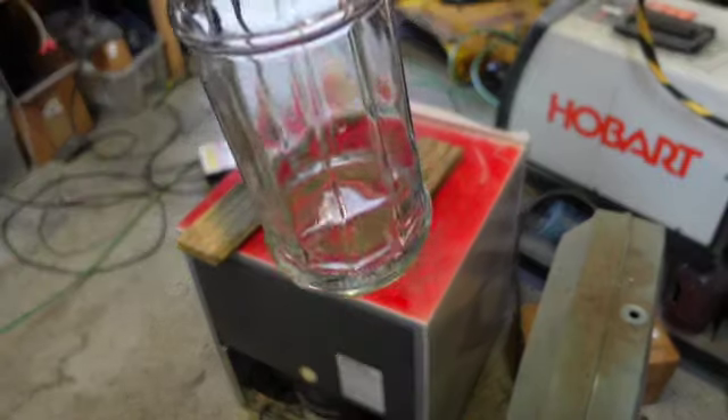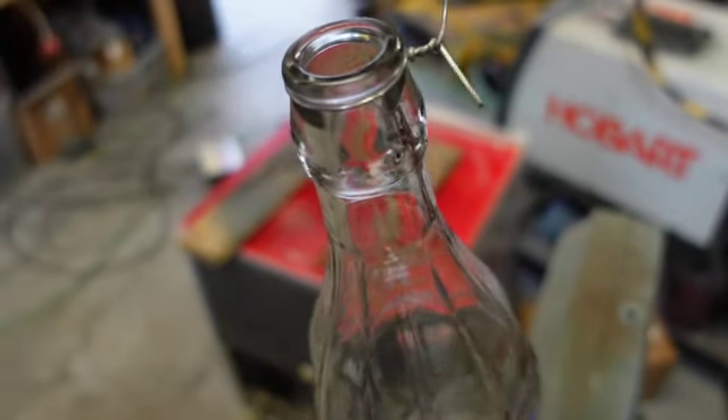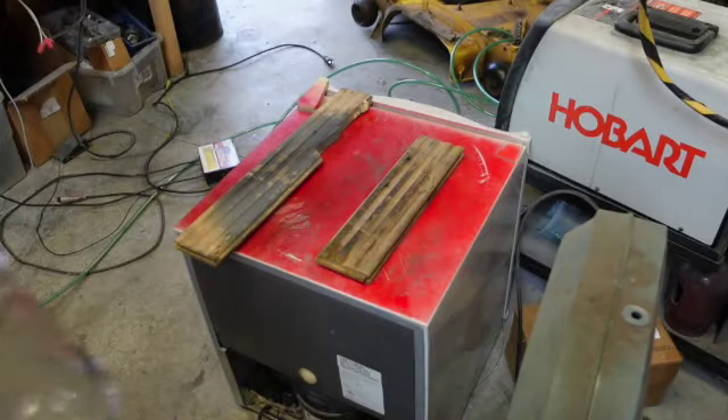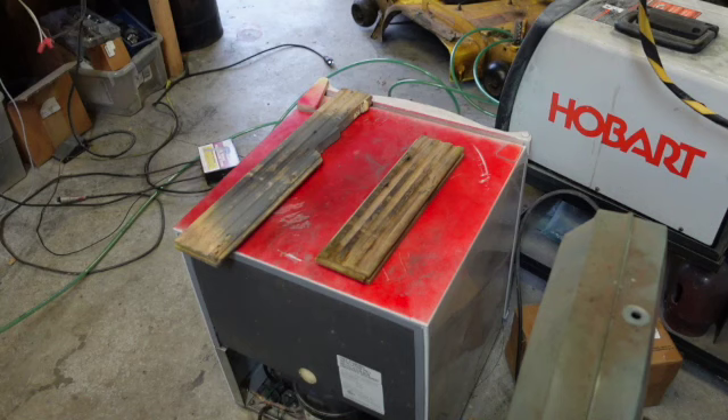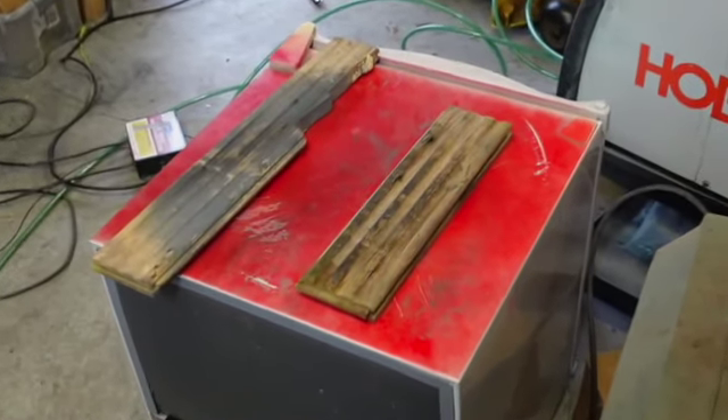There's some storm out there. Here's the bottle - I was thinking the holes here went all the way through but they don't. Guess that makes sense because it would go rancid. I've got a lot on my mind. There's the bottle and we're getting ready to pull the tiles out of the oven. I'm heating them up a little extra hot for hot coating - we're not trying to bake powder on, we're trying to melt powder on. I'm at about 425 degrees for 10 or 15 minutes to heat it through, and we'll see if we can get this stuff to stick.